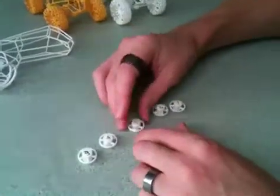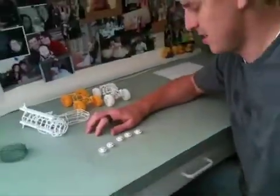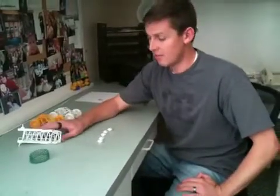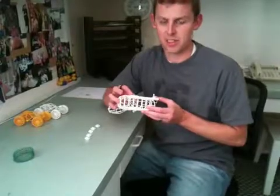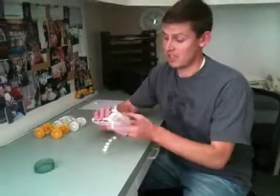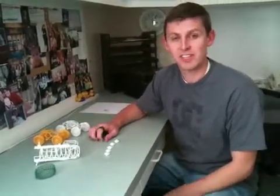Shapeways does recommend 0.5, and as we can see with 0.5, it took a while but it worked. Using that, you may be able to make some pretty cool interlocking parts, gears, and mechanisms. You need to be really careful because I followed the guidelines when making this device right here, but there are parts completely fused together that will not come out. So if you're going below the design guidelines, you're taking a big risk. You can check out some of my work at the Stinger Designs shop at Shapeways — good luck with everything you guys are making.